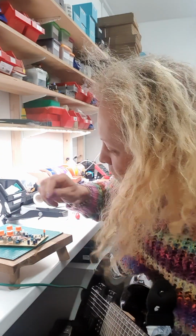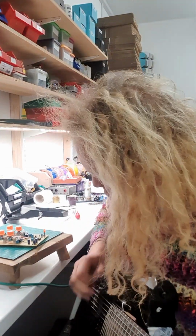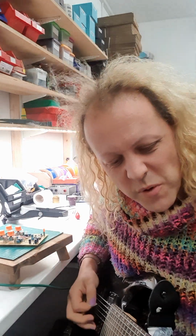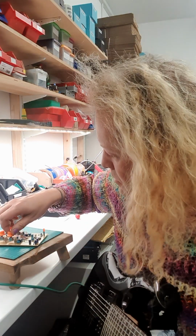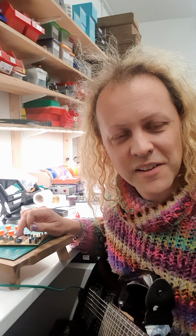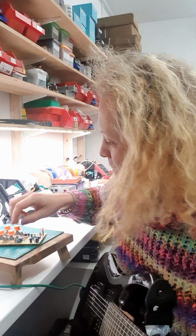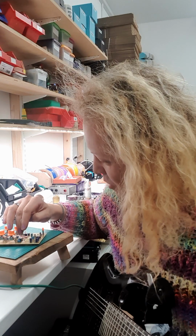The mid control works as a standard sort of American mid initially. Has that kind of wah sound. All the way to a scoop. And of course it has a frequency shift. I'll use it in. You can hear it go from a very sort of 700, 600, 700, 800 hertz down to like 200, 300 hertz, which is a really cool sort of bass mid. So there's two really good frequencies we get through the mid control.